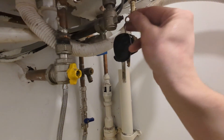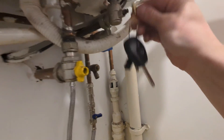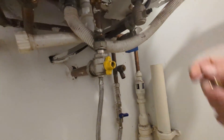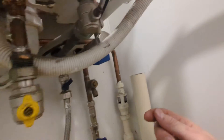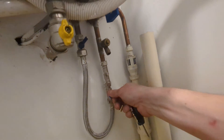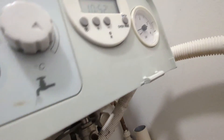Hose off the drain valve. Close the drain valve — basically just a radiator bleed key, which is nice and straightforward, a bit like what you'd get on a Baxi. Open the flow. Open the return. Re-pressurise the system and the boiler all together.